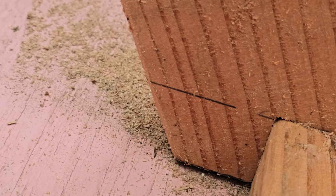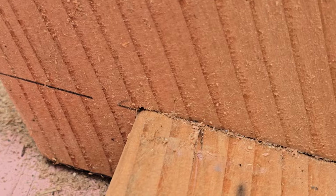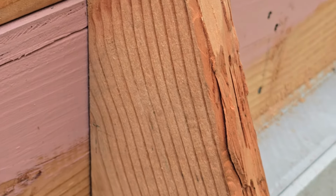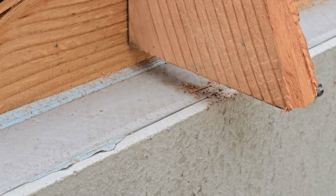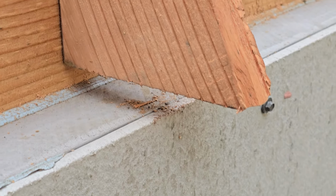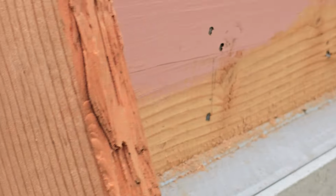This is a little awkward to get in here, but you can kind of see there's a little piece of that bottom of the rafter that tucks in, and when we're installing it, it's very handy. That jams it against the ridge, or against this base plate, and prevents it from going too far out and getting away from you. And then this tail represents an overhang, and eventually you'll see cement board over foam. We're going to fill in the gaps between the rafters with foam board, and then probably we'll make some kind of a ripped down 2x4 board that will go against the tail of that rafter into the cement board, so the whole thing will be completely sealed off, which it basically already is with caulking.